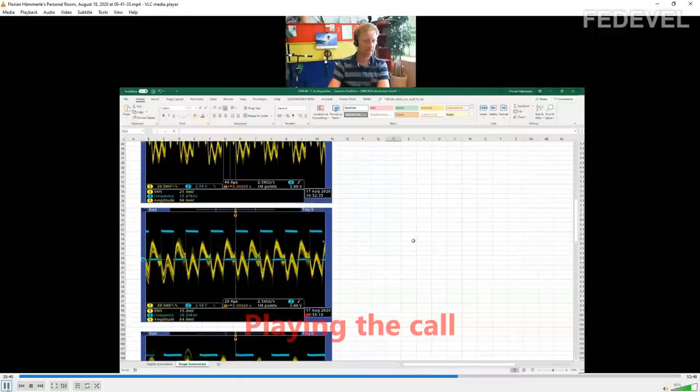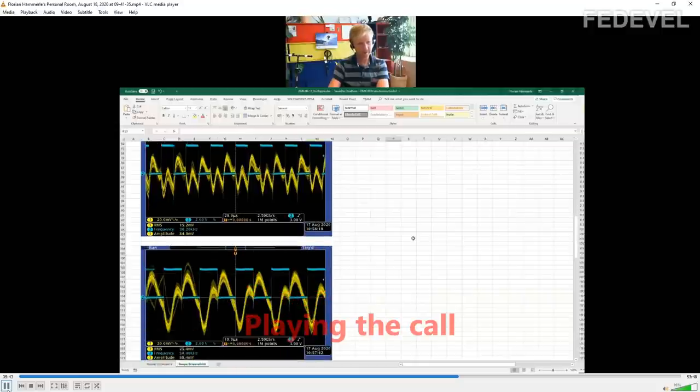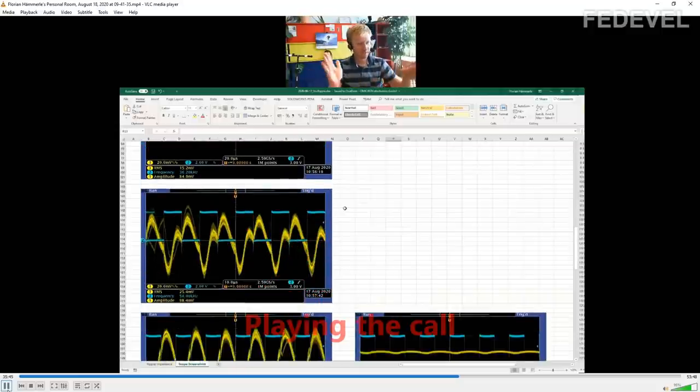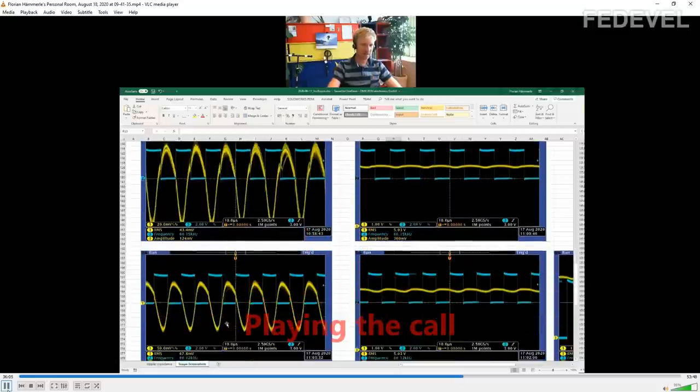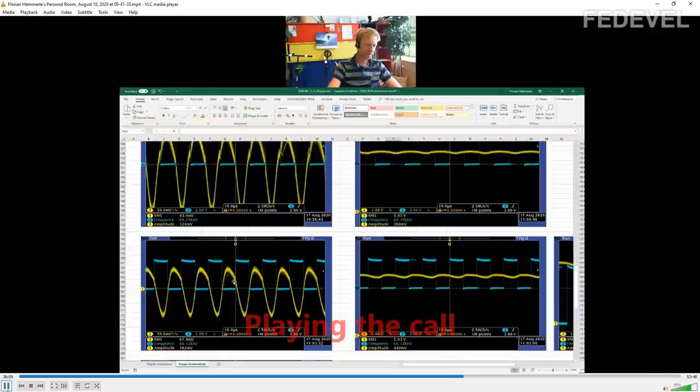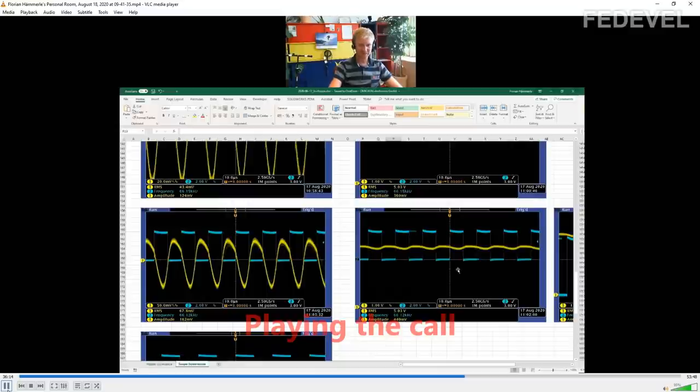And if we make the frequency even higher, eventually we can find the resonance frequency of the resonant tank and just trigger a nice oscillation every time. Every time switching on, off, energy is pushed into the oscillation at the right moment. It's not the perfect one. You can see here it could probably be even better. Here at 66 kilohertz, that's nearly a sine wave already. And that's already very high voltage, you can see. 200 millivolts.